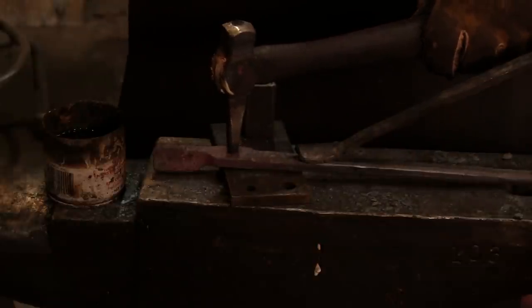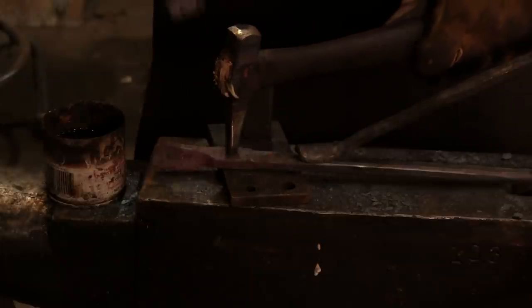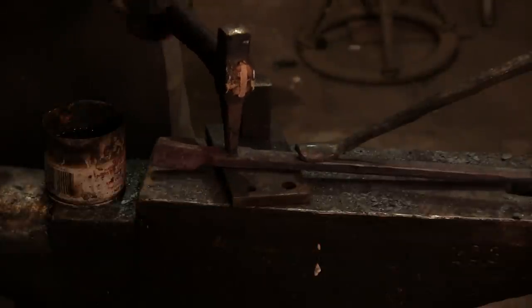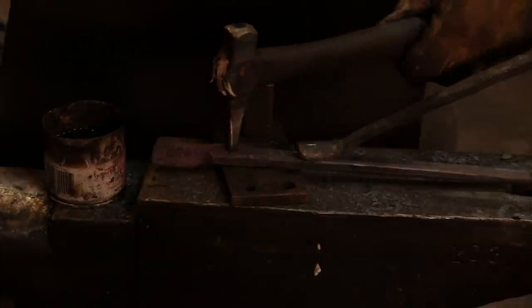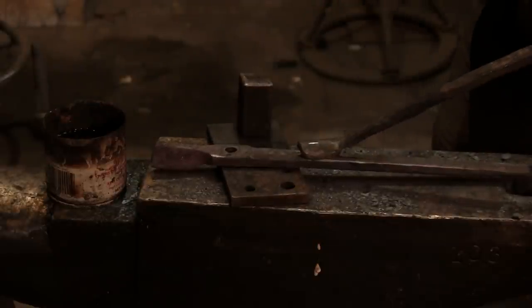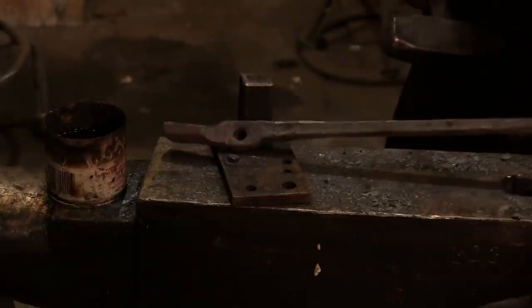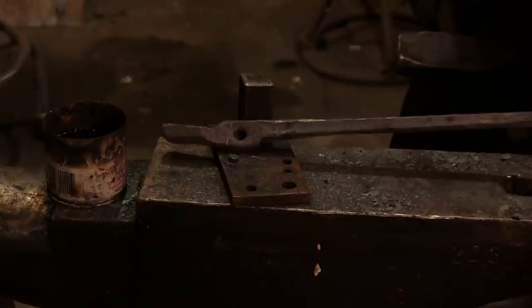I come to the back side. And if you do this at a darker heat, what it does is it actually shears the plug as opposed to tearing it. Now, if there's any place it's going to stick, it's going to be right here. But again, the coolness makes it want to break out as opposed to tearing. And if you do the job right, look at there, plug comes right out. And there is our hole.